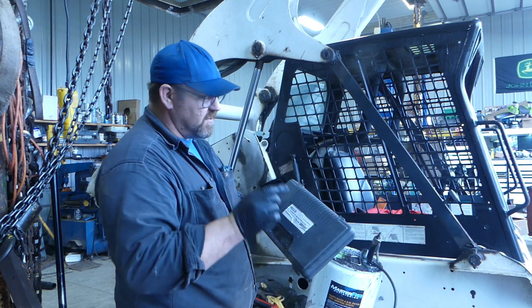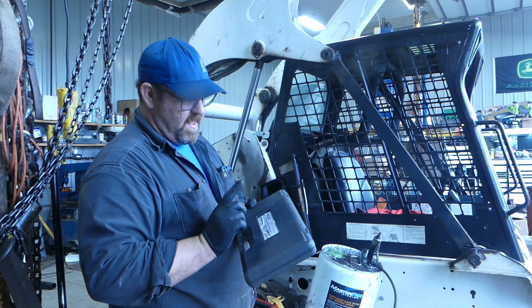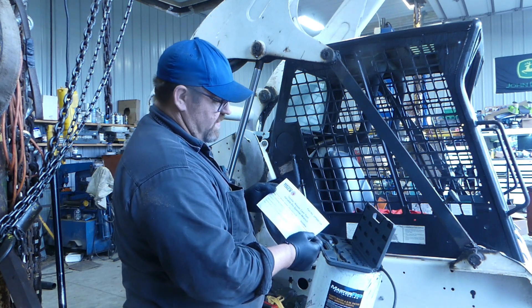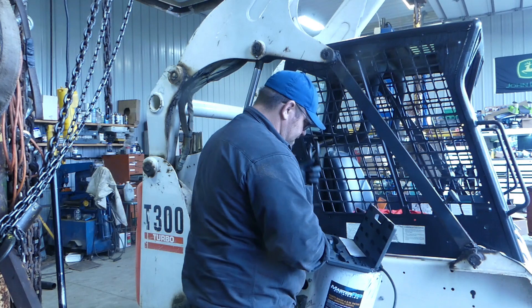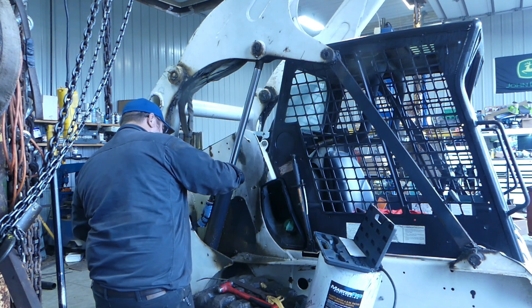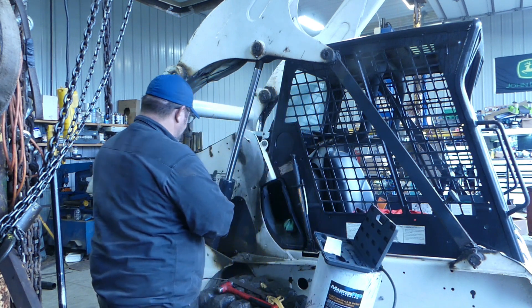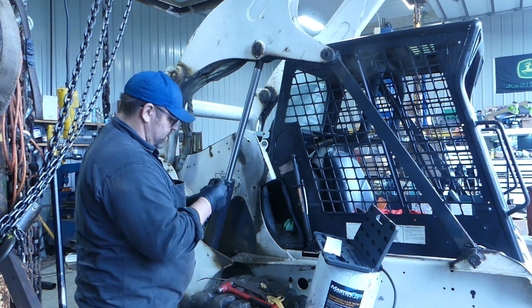This is the Matco - part number VPS 661 3A, variable spanner wrench set. I guarantee it's rebranded by somebody. This is actually the Nissan/Toyota cam tool, and I bought it for this part. It does have adjustable dowels, so you can put in whatever size dowel pin you need. It's got a whole bunch of different dowels you can use. You want to pull on this part - that's how it's worked best in the past. Set one dowel, set the other dowel, now let's see if we can break this loose.